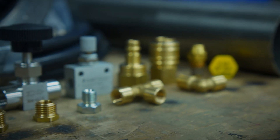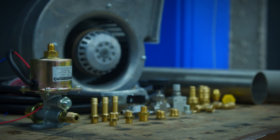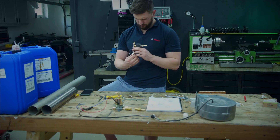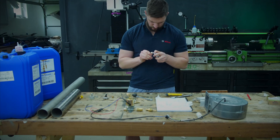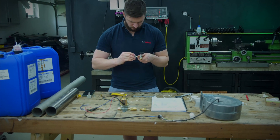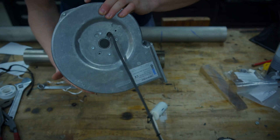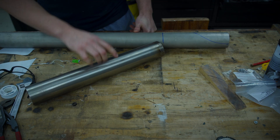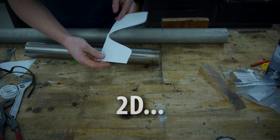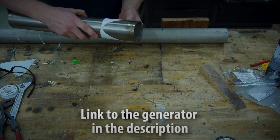The plan is simple. Use some pipe fittings and stainless steel tubing to connect a radial blower fan with an electric fuel pump and an oil nozzle. I've added here a little shelf for the combustion air. I'm planning to use this blower here. Basically we need to join these two pipes at a 30 degree angle, so I have 3D printed this guide here and this guide should let me do a perfect cutout in theory.